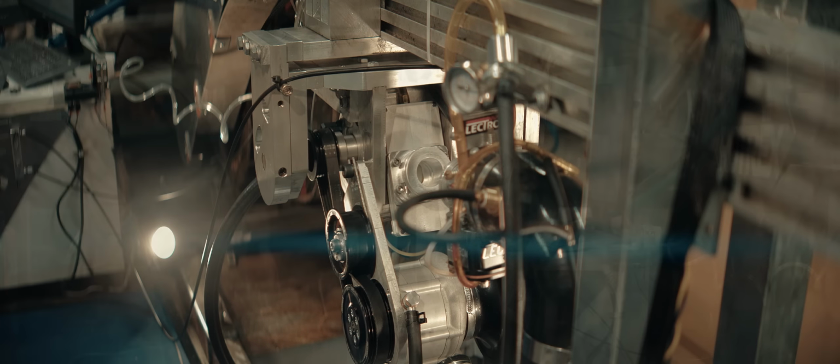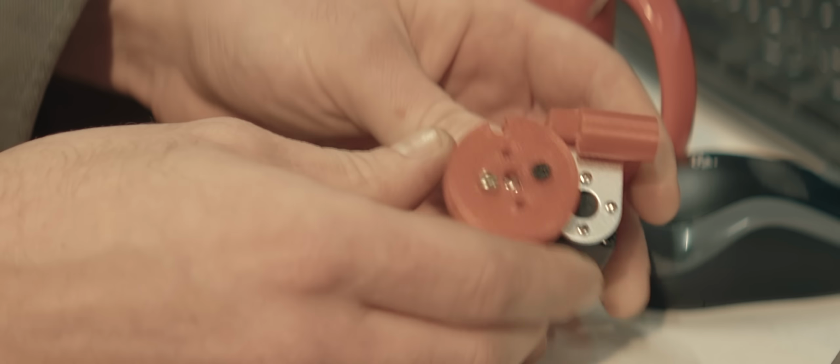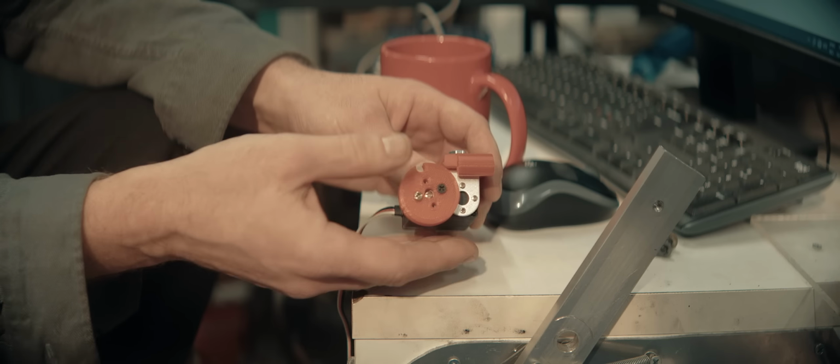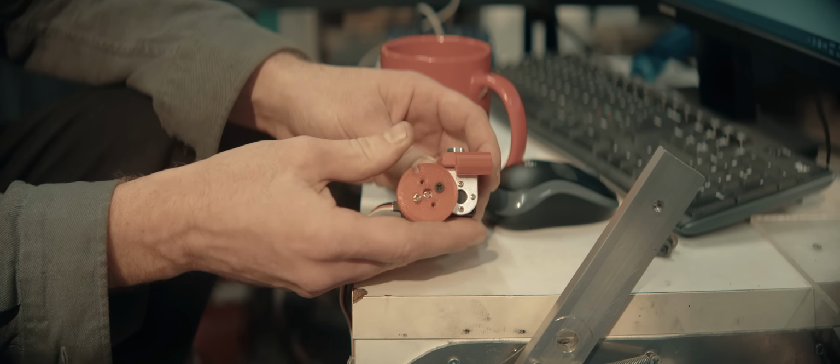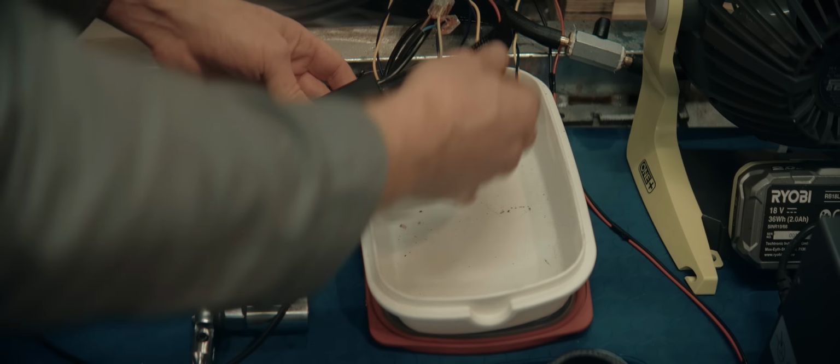Plan is to switch this out with a servo and have the ignition unit control it. This exact servo with these wire pulling attachments were actually meant for this purpose. This was back in the naturally aspirated PIP engine era, and that valve was just an air valve, not a sliding reed valve. This Ignitech unit actually has means for controlling servos.